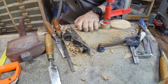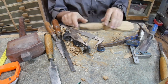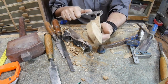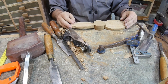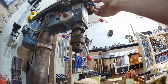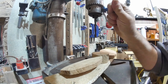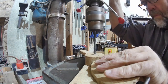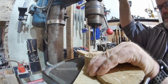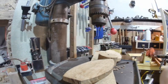Now I just want to check I'm maintaining the thickness on each blade. I've got a lot more material to take off, but I didn't want to get to a point where I have a bad balance while I'm working. So what I'm going to do is put a hole — a drill bit in the center of the propeller hub. The reason for this is so I can balance the blade as I pare it with a chisel, otherwise I'm at risk of the blade being seriously out of balance. It's best to try and balance it as you go.